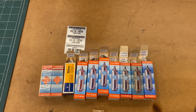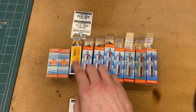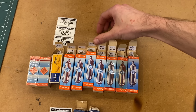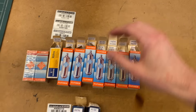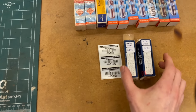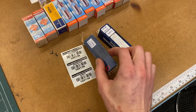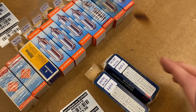Let's start with the set of vacuum tubes here — these are all seven 6DJ8s, all Siemens tubes rebranded as Telefunken. They all test near new old stock on the Amplitrex AT1000, and many have very similar date codes, so this will all be sold as a set. If you've got an amp that uses 6DJ8, this might be a fun thing to experiment with. A couple of these are true NOS, still sealed. We also have a couple of Mullard E88CCs down here — they don't test new old stock but they are very strong, with similar date codes.